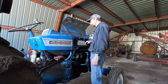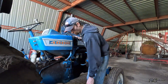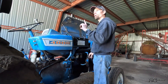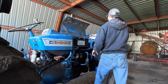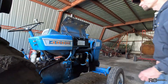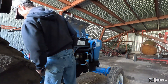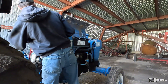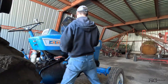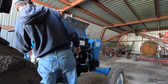Anyway, I've thrown the battery back in — it's fully charged. Now I should be able to start this tractor, and if it starts I want to kick it outside where I can work in the sun. I think the battery was dead because the generator wasn't charging, and it probably wasn't charging all last year. This tractor's been sitting all winter, and now it's spring and they want to use it.